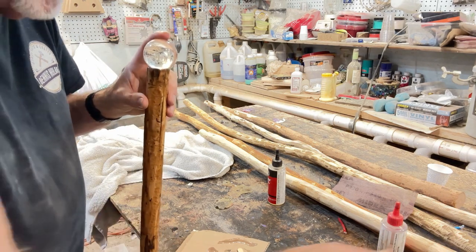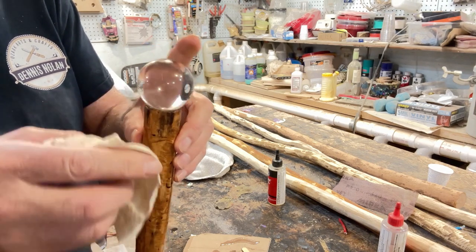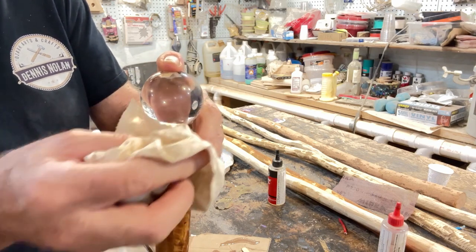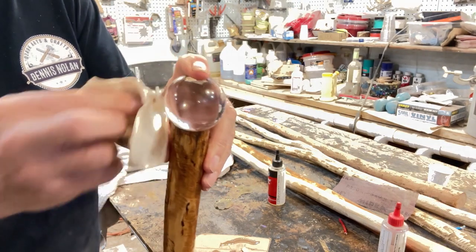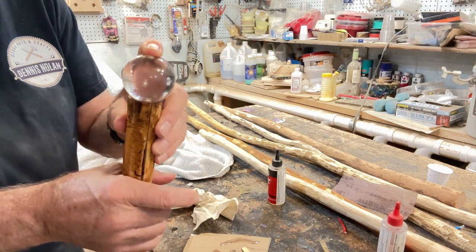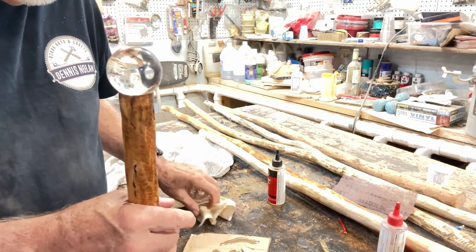But what I'll do now is take my soft cloth and make sure I don't have any epoxy that's run out on the side. And what we want to do after that is just walk away, prop this up to where it stands straight up like you've got it now, and come back. Forty-five minutes, 15 minutes they call for, say, is enough, and that probably is.